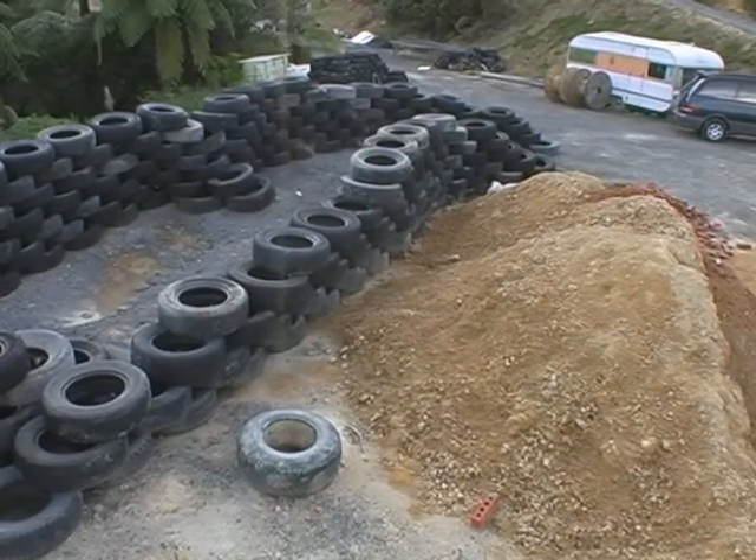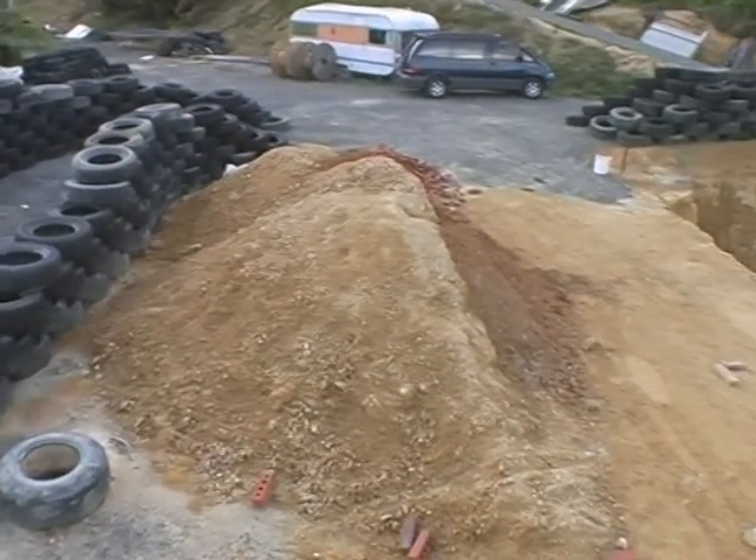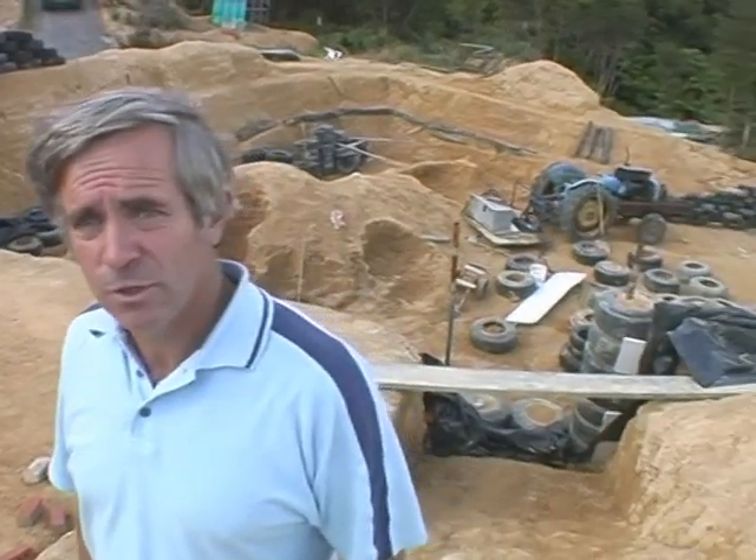As far as the roof goes, we'll just be having a conventional roof. We'll be using it to catch our own rainwater so we'll have a rainwater system for all our water needs. We'll also have solar PV panels on the roof for our electricity and solar hot water systems as well, so that we can be completely independent of the national grid for our electrical needs. We'll have about 300 square metres of roof, so that should be ample.